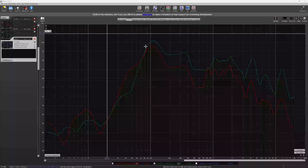I'm not sure if the dip has something to do with tuning frequency. This box was supposed to be tuned around 85 Hz, but as we can see, it peaks closer to 100-something Hz. The port tuning was probably a little off because I flared some edges and had a 90-degree bend inside — it's hard to figure out exactly what the port tuning will be without a lot of extra measurement in CAD. For this project I kind of just sent it. This is all very near-field — less than about an inch and a half away from either the port or the cone.